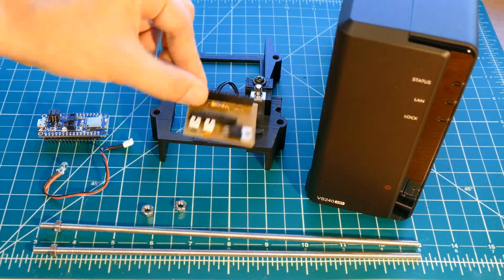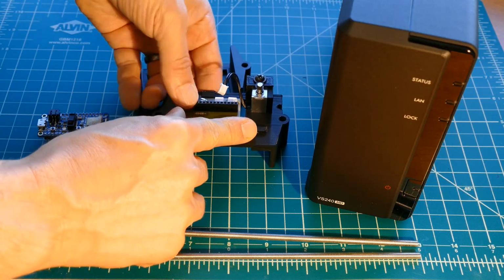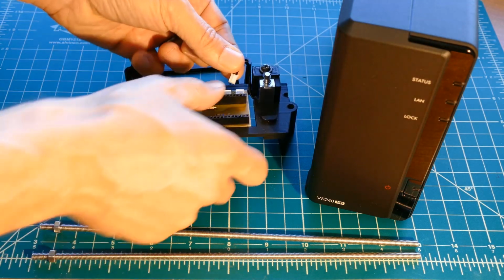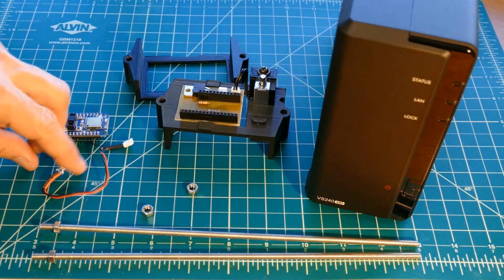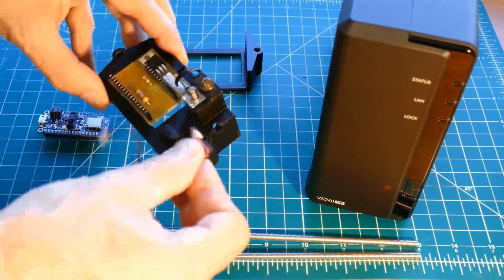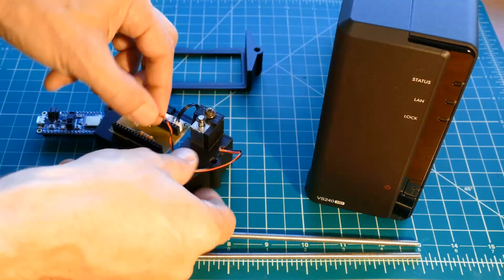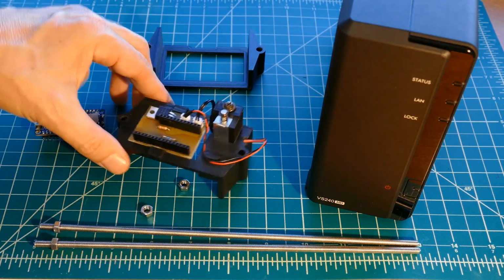Here's the etched PCB with the components soldered on. It snaps into place on front of the bracket and is held down by clips on top and bottom. The male JST PH plug from the solenoid goes to the right connector. I soldered the green LED to red and black wires with another male JST plug. The 5mm LED snaps securely into the side hole in the bracket. It then plugs into the left connector, and there's a clip to manage the wires.